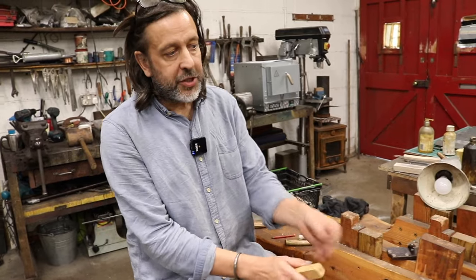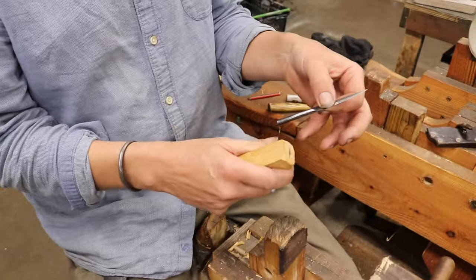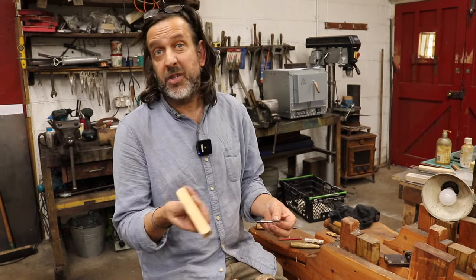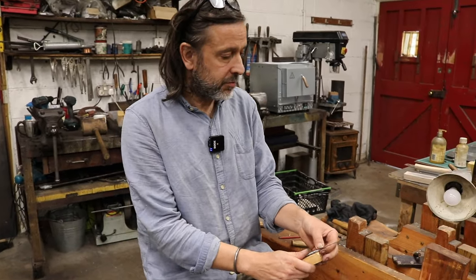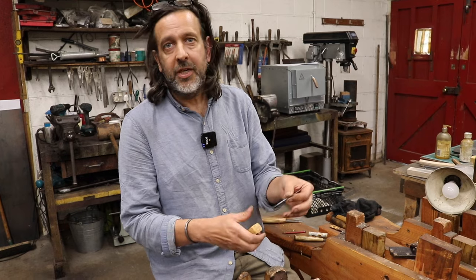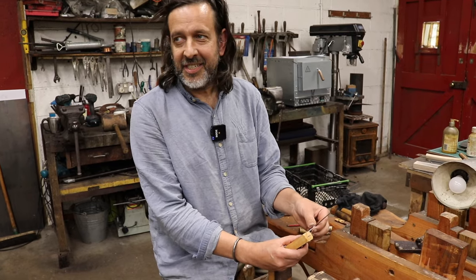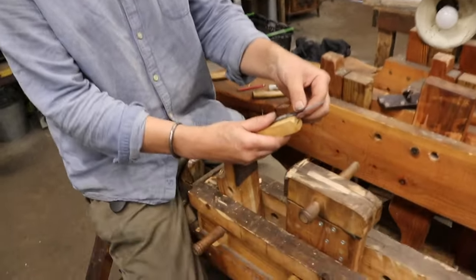Is it green or seasoned for the handle? If you're shaping it yourself, I'd recommend a semi-dry state, not kiln dry, because it's easier. You can glue it on in a slightly green state because it's only going to shrink on, but you don't want it sopping wet. I've got this alder which is very dry, but alder being alder is nice and soft, so that's fine. You don't want it too dry, but it's not the end of the world.